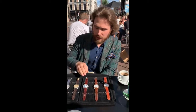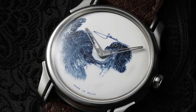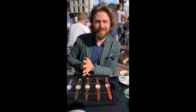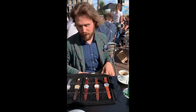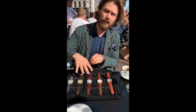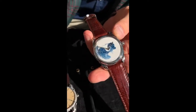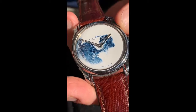I did an enamel course because I thought enamel should be the way to go — it's very classical in watchmaking. But with powders you're still placing them by hand, so you control the position with your brain and never get a real spontaneous effect. That's the idea behind this Delft Blue design. The nice thing when you work with fluid materials is that you also get differences in tones of the blue, which can be fascinating. This is the idea — every dial is different, and the client can choose which one they like most.